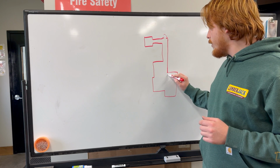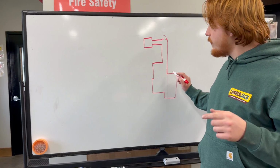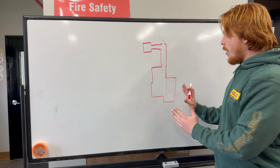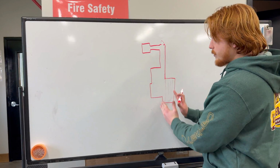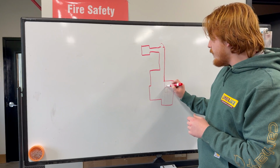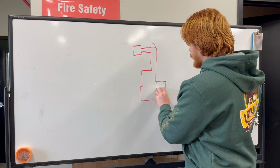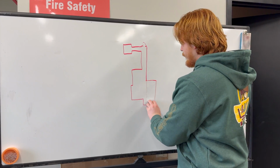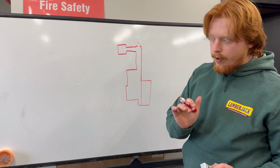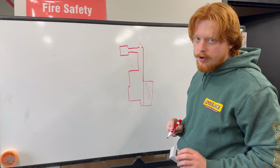We went and coated this section here and cut a straight line here. If you remember watching the video, our boards were going this way, right? So all of our wood floor was going that way. I had mentioned you don't ever want to coat across the grain because you'll leave a line there and it'll be visible on the floor. So while you're coating, you have to make sure you keep a straight line. What I mean by that is cut yourself a line across the floor that follows the boards, and you would just stop right there. This section is done being coated now.